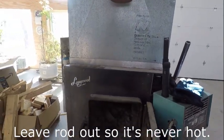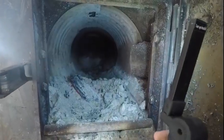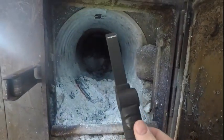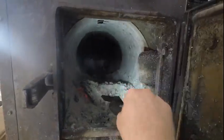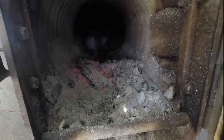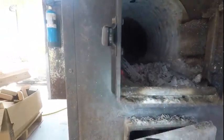That way you're not going to get your reclaimer plugged up with creosote. Here's inside - this is after a night of use. Let me get some more light in here so you can see. There are a few coals right here in the front, and some ash all the way in the back. What you're supposed to do is rake everything to the front, because the front has holes in the grate where ash falls through down into the ash drawer.